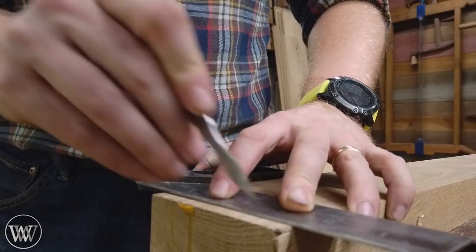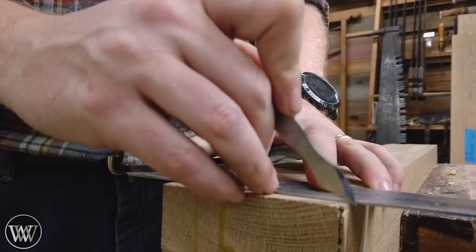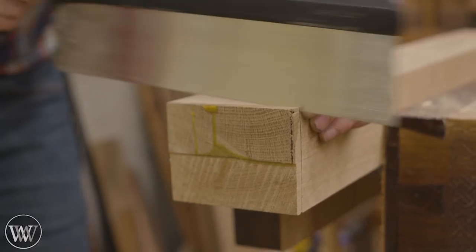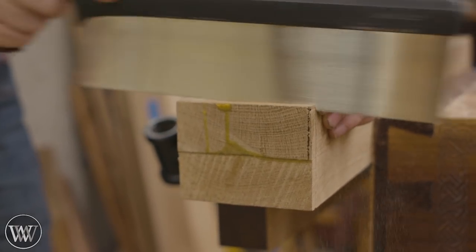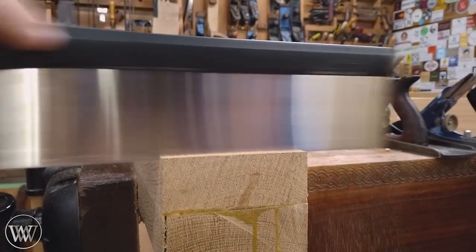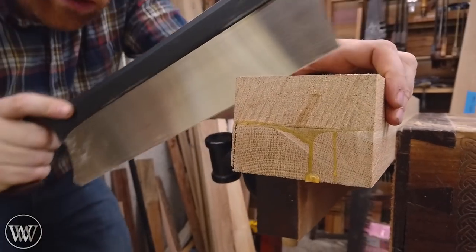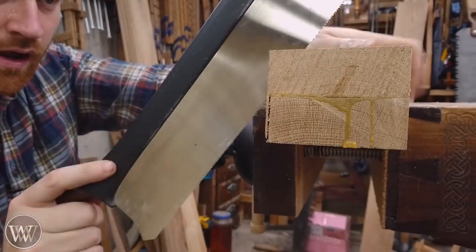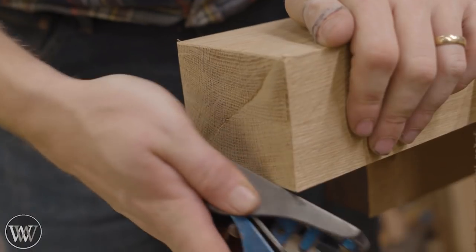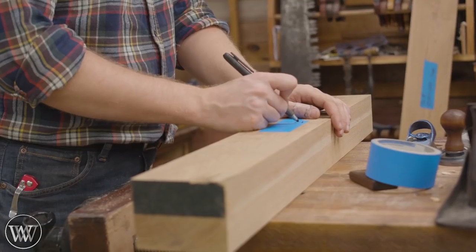I'd be amazed what you can do with winding sticks - not only do they tell you about wind but they're also a good straight edge, and a fantastic tool to have for something so simple. I have a couple videos on making those if you want to see it. Next thing I want to do is cut the leg to length - I left it long so I can cut a little bit off of both ends. I draw a line all the way around making sure that the square on my fence is referencing either the reference edge or the reference face, and not the other two faces. This way I know I get a good perimeter line all the way around. I drop down on one knee so I can focus on cutting down the line on my side - I could have done a little bit more but I was pushing a little bit harder than I should have, which allows the saw to wander a bit in the cut, but not too bad.